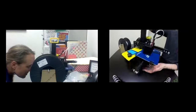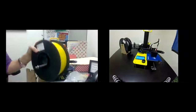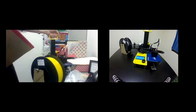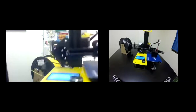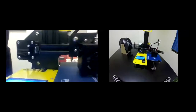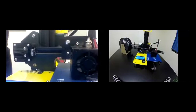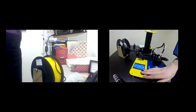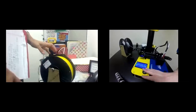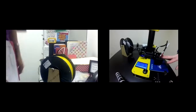Pick up the printer and move it towards me so I can actually look at it. Let's go ahead and stop the print — click the button once and select Stop Print. It should stop the printer and stay still. If you want to move it, go to Setup and Disable Motors so you can move it again. Go ahead and take a look at the build plate and see if you have a little block.